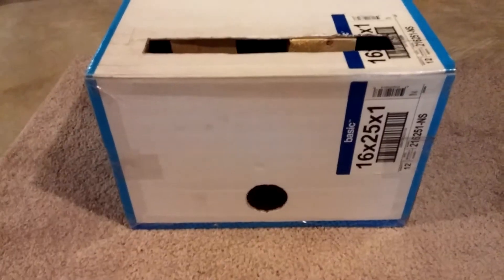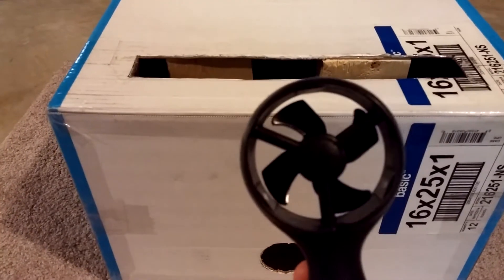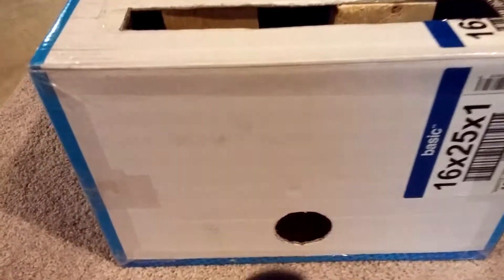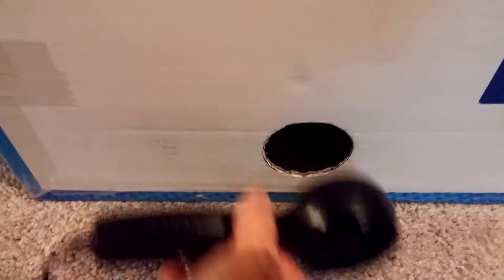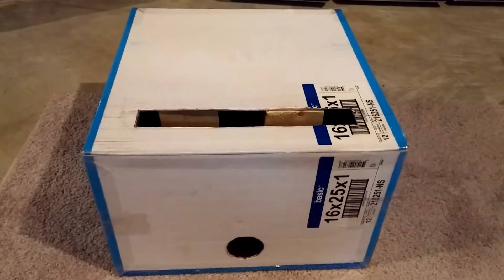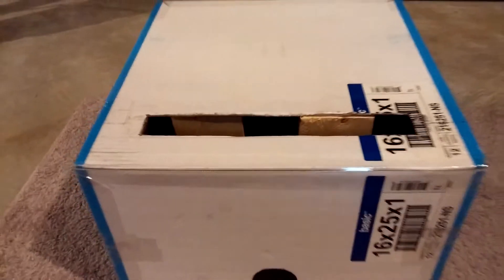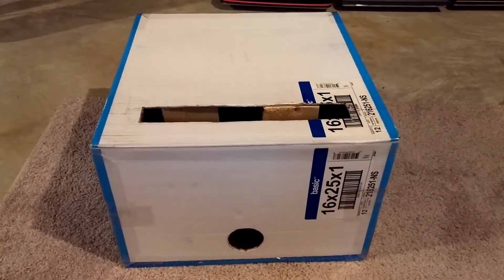I also want to emphasize that this is not for suction or water lift tests. When you go and take your detector fan for your anemometer and put it up to the detection hole — if you happen to accidentally block the hole with your hand, like say you're pulling 137 CFM from a Kirby Centria 2 that I have upstairs — the box will actually crush and the sides will just crush completely in, and you'll have a collapsed airflow box. So that'll be no fun.